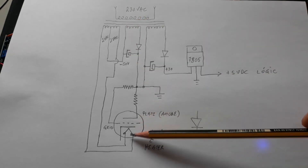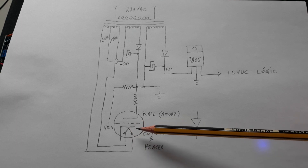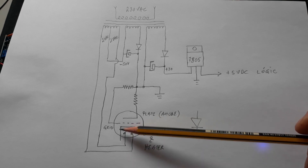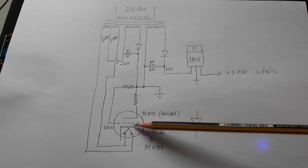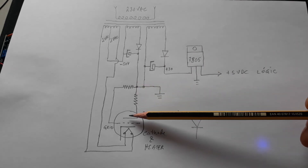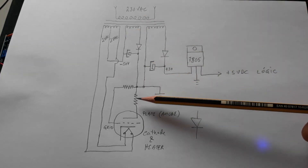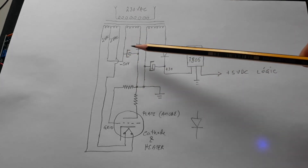The tube is here and you can see I don't connect the cathode to anything separately because in the VFD tube the cathode is the filament. It doesn't have a physical metal to represent the cathode separately — the cathode is the filament. After you have the grid, and after you have the plate. I use two resistors to polarize both the grid and the plate at the same time, because I don't implement any control here — this is only to exemplify how to polarize the tube.